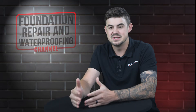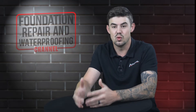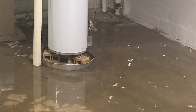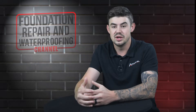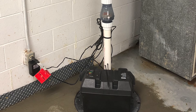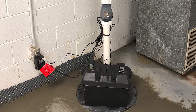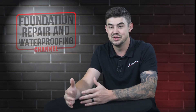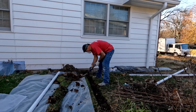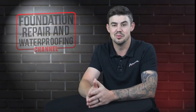The very basics of any basement drain system — whether it's exterior, interior, no matter what it's made of — its only goal is to capture the water that would be coming onto your floor and route it away from the home. Whether that's into a sump pump in the basement that mechanically moves the water away, or exterior drainage that daylights out to a creek, a ditch, or even a manhole, the whole objective is to get that water around your foundation away from your home without it coming into your basement.